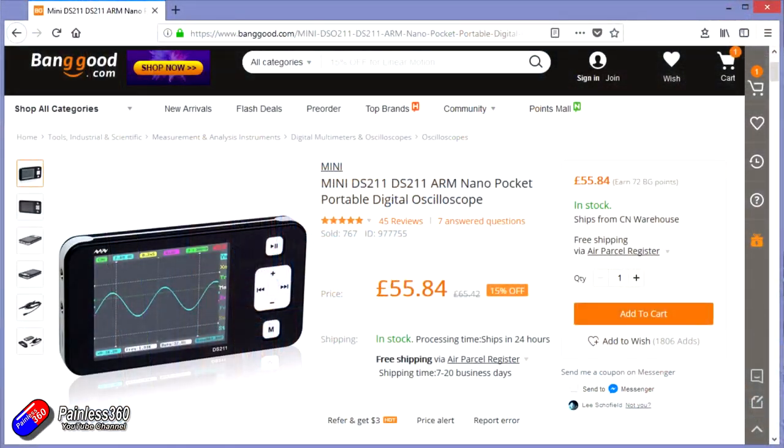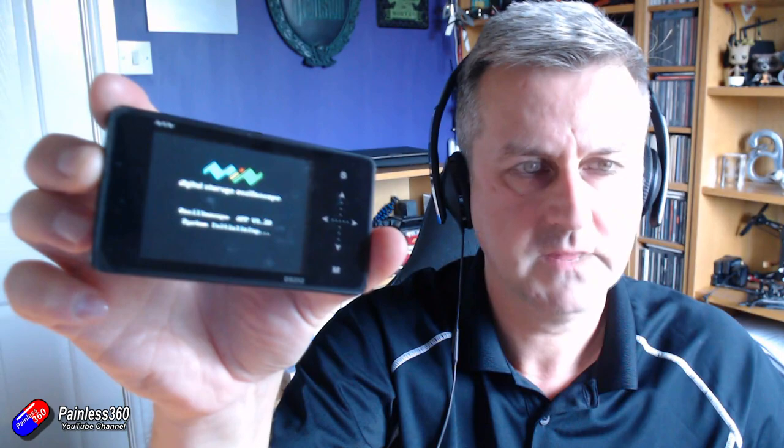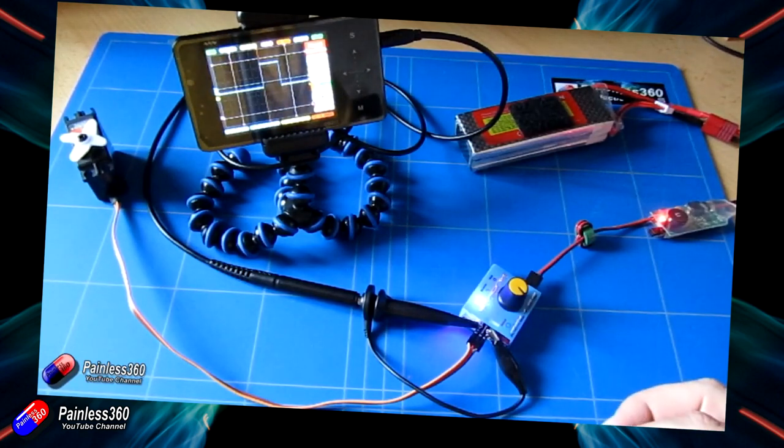There's one other thing I'll show you which is something I actually use a lot - it doesn't tend to get shown in videos. This is actually an oscilloscope. When I started with electronics, oscilloscopes were great big briefcase-sized things. But this, believe it or not, is actually a little oscilloscope and I use it all the time to sort things out. It comes with probes you can plug in. It has a little screen, it's two channel, and quite basic in functionality compared to a full size oscilloscope. But this is worth its weight in gold when you're troubleshooting, because you can just plug this in and play around. When I was doing that troubleshooting with the I2C stuff, you can just check that the signals you think are happening are actually happening. Things like this are great to plug into receivers where you're not sure if there's any output coming on the PWM pin - plug something like this in and it will show you straight away.